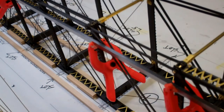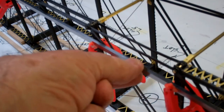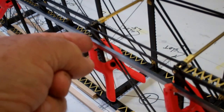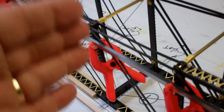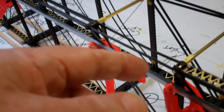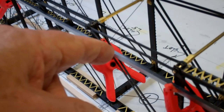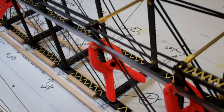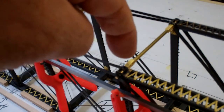I took one of the steel bars that come with the kit and placed it along the side of the columns from one end to the other and clamped them together, because I found that many of these columns were not exactly perpendicular and in line. In so doing, I'm hoping that when everything is installed with the I-beams and the diagonal bracing, that will hold them all in line and plumb. Now what I've also done is I've completed installing the I-beams in brass in the shoes.